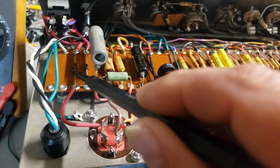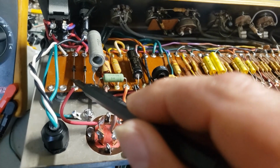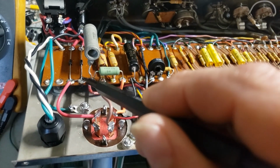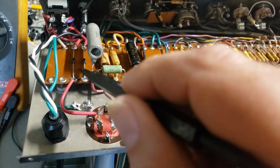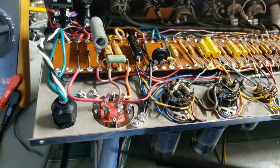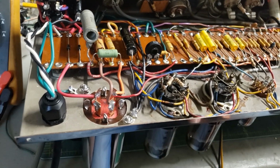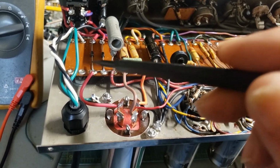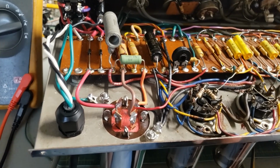It had really ugly diodes here. I've put in these two. I might actually go back now that I know what the final B plus of the amp is and do some in series. So instead of single 1N4007s, I'll have 2 per side. So instead of handling 1,000 volts on the peaks, it can handle 2,000 volts on the peaks. It's not that likely that you're going to get 1,000 volt spikes, but diodes are cheap enough. A little bit of peace of mind won't go amiss.